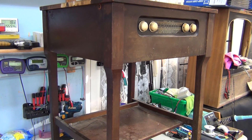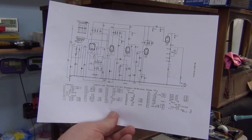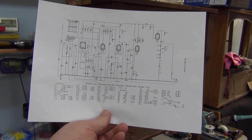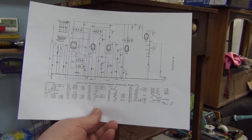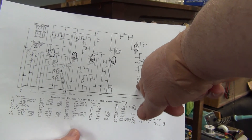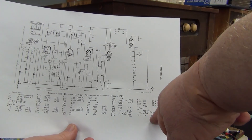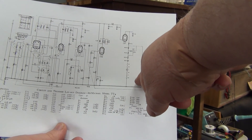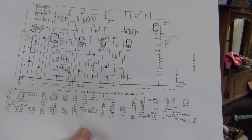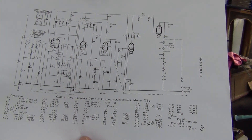I hate series-strung things like this, and this is no exception. There's the circuit diagram — this is out of the Radio and Television Servicing Book for 1956, I think. It's a medium-long-wave radio which is series-strung. It has a half-wave rectifier, and the light bulb for the dial light is 0.11 amps, so it's part of the heater chain. Then you've got a dropper resistor and pretty conventional electronics. So we're going to take all this out — we're not going to be powering it up because I don't want to damage it.